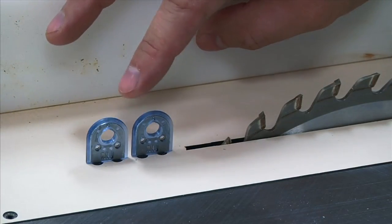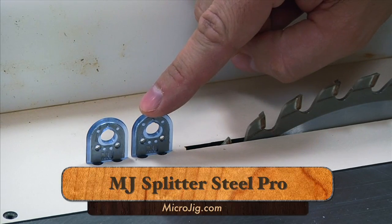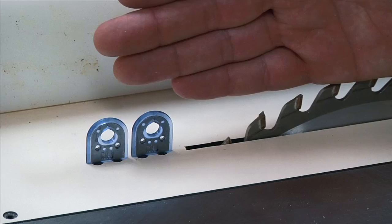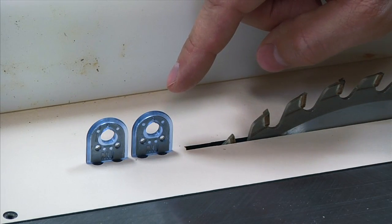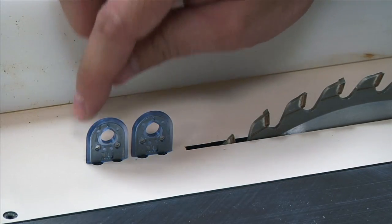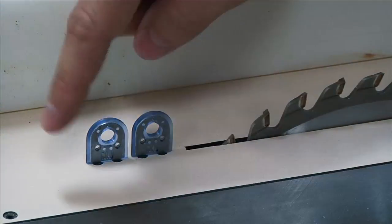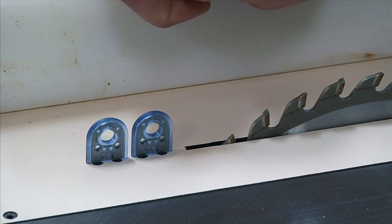What I have installed here is the Steel Pro version of the MJ Splitter. It has a stainless steel body surrounded by a polycarbonate plastic layer on the outside — very durable stuff. As you can see, it's right in alignment with the blade. This is not that difficult to install because they give you everything you need. It takes about five minutes and you'll have these holes located perfectly in your zero clearance insert. Really that's the only other thing you need for this installation: a new zero clearance insert that doesn't have any material in the back removed, because you need to drill into that space.